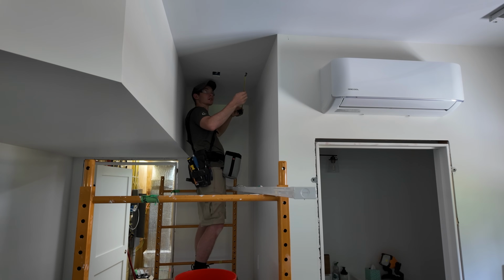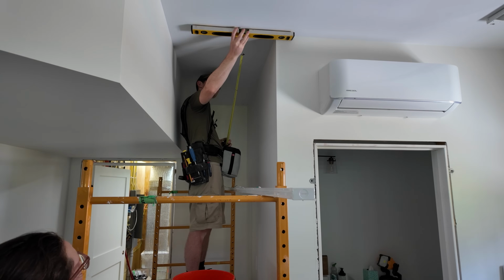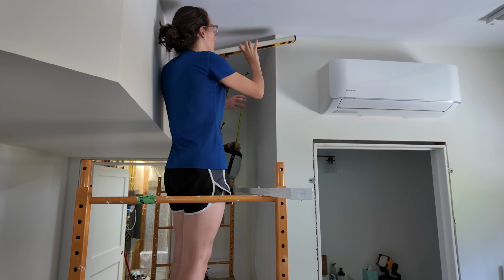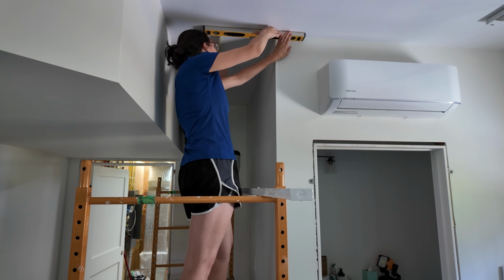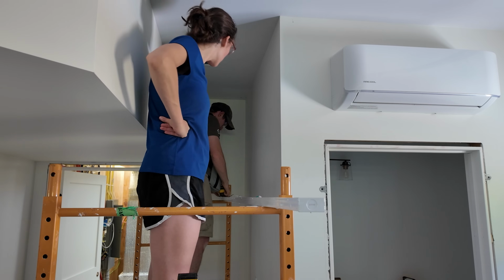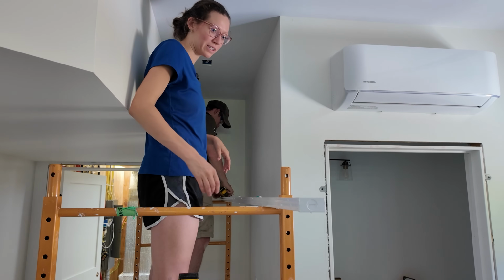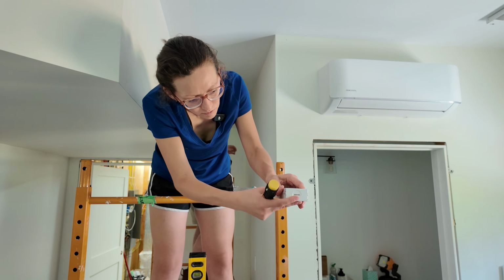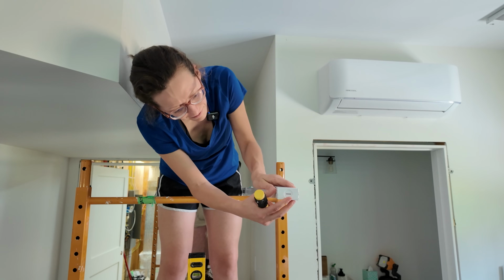It looks pretty close to where the knockout's gonna be? The knockout is actually. Why don't you make a little mark on the ceiling and then we can lift up the light. You want me to hold? That would be good. All right, so you're just extending that wall, so I have somewhere to measure from. So you just keep it flat against that wall. Okay, now I need to come to 11.5, and that's the end of my light. So, our actual knockout, oh my gosh, it is legit at 7 3/4. Did I plan that? Holy hell. Maybe you figured that out earlier. I don't know how that worked out, but maybe I did do that. I don't really remember doing that, but maybe I actually located this box to be 4 foot back.